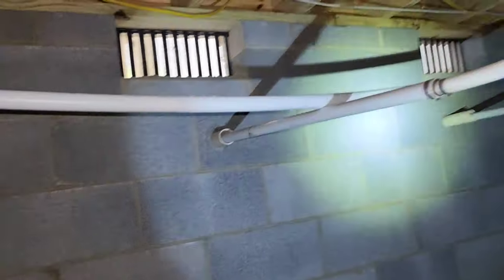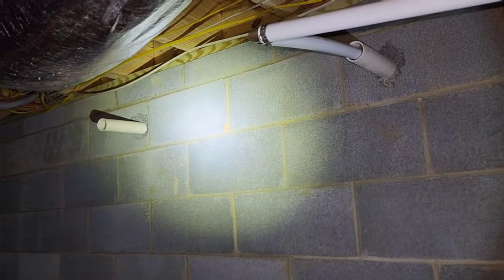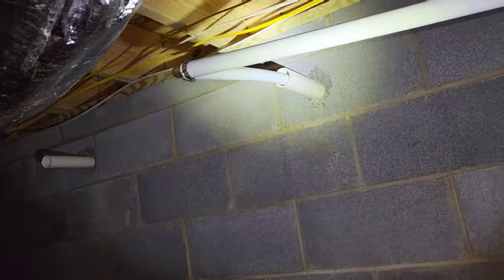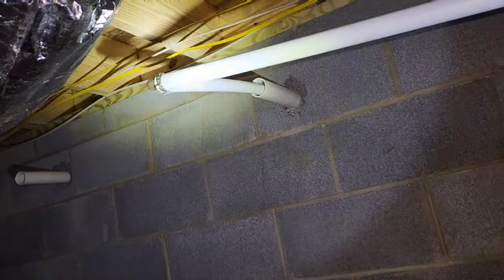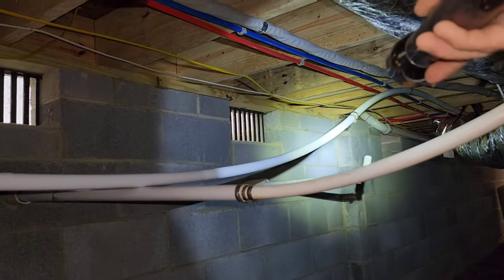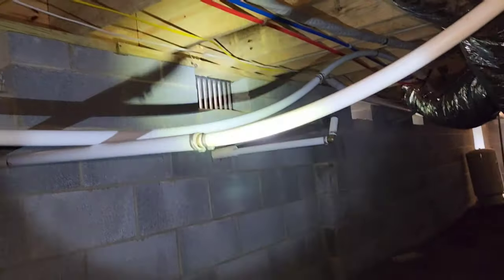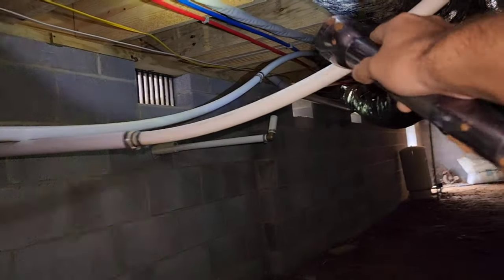We are back under the house. These right here — that is my old port and my old sleeve, and that one is my new sleeve. This right here is coming out of the tank and into the filter. That one's going to go out of the filter and into the house. I've already connected right there. I need to go get some pipe clamps and clamp it to the floor joists, and then cut this pipe here and connect it over to that. That's what I'm heading to do next.